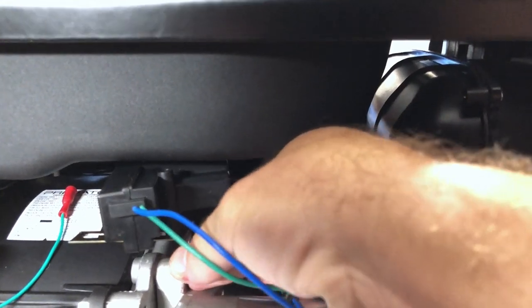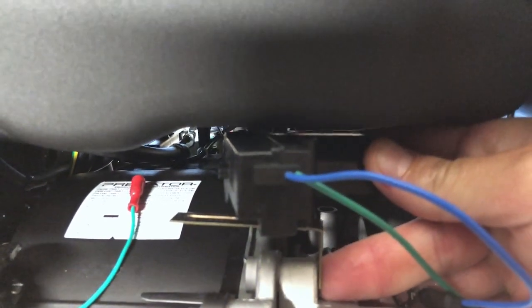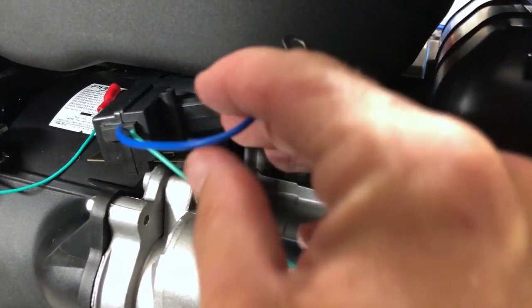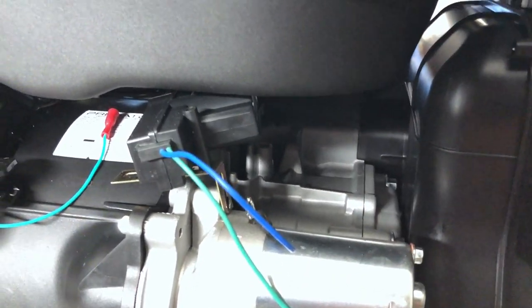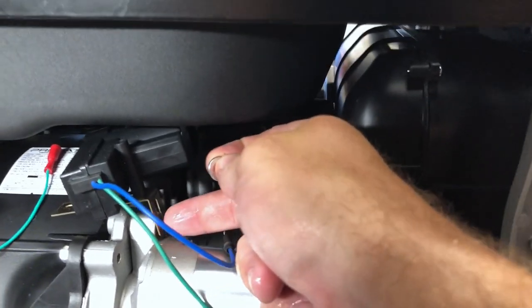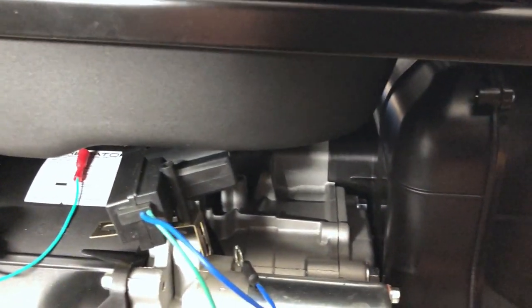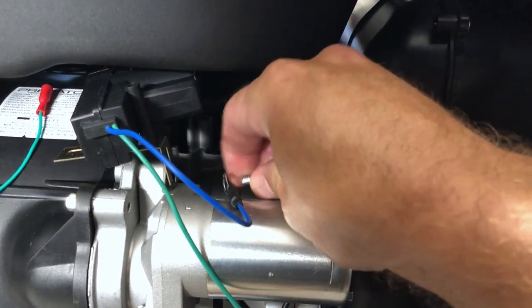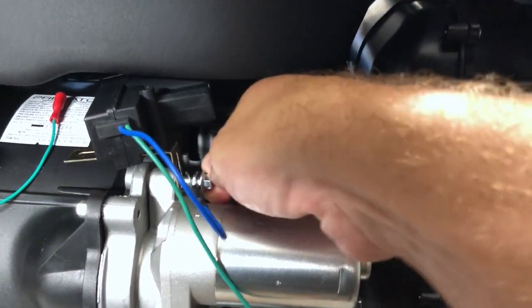Pre-cut and mounted onto this bracket at a good angle for it to go right directly back in line with that choke. The blue wire is going to be our ground for this application — you're going to want a pulling action, so blue is the ground and green is the power. In the kit we have a lock washer. We're going to do: the bracket, ring connector, lock washer, and then the bolt back on. Put the lock washer on the bolt, feed it through the ring connector, and get it started by hand directly into the top of the starter.